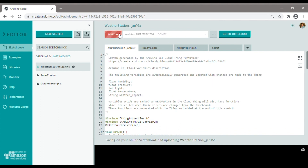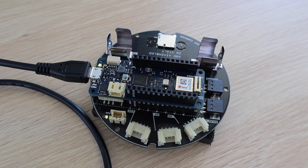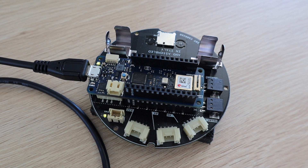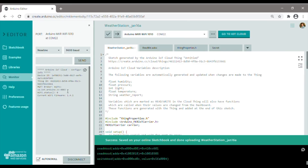Let's try to upload this sketch to our board and see how it works. When the board is mounted onto the carrier it makes some ticking noises when the sketch is uploaded as the two relays are energised and de-energised. Once the code is uploaded we need to open the serial monitor to allow the board to run, as there was a pause for this in the setup function. We can then see that the board connects to the Wi-Fi and then establishes a connection with the cloud.